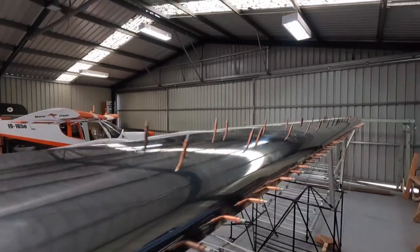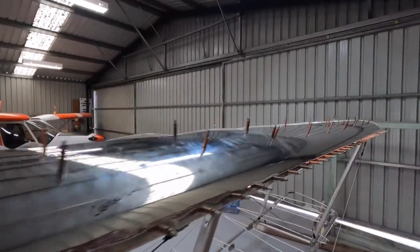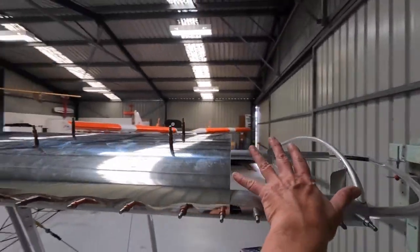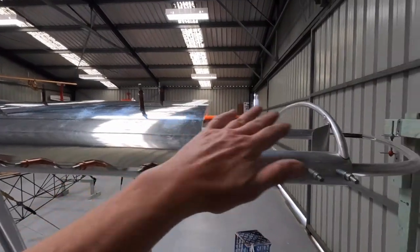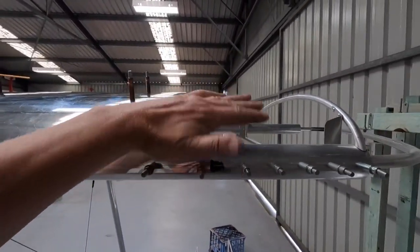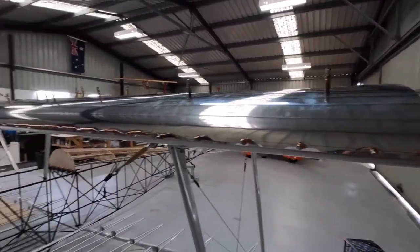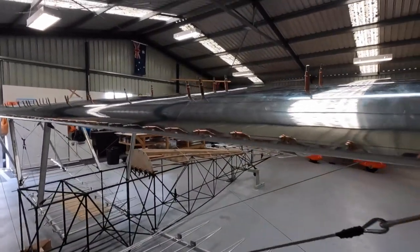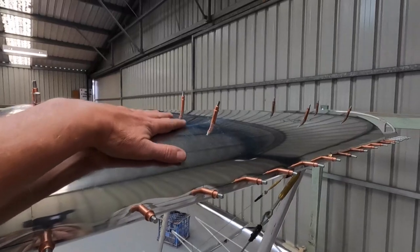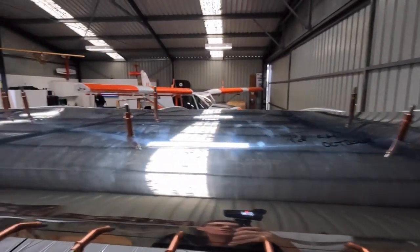All right, top wing skin all done — cleco joined. Unfortunately the pieces end up about eight inches short, so there'll be a capping piece at the tip — I'll make something up for there. It's obviously eight and a half feet wingspan, two four-foot sections. All turned out really nice — just went with two rivets; it stops oil-canning the skin too much. Looking good.